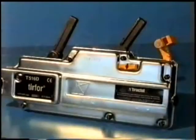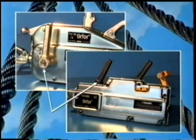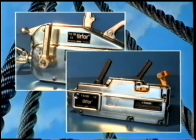The forward lever of Tirfor machines is fitted with shear pins which protect against overloads. These pins shear when too much effort is applied. However, the load is always held securely and reverse operation is still possible to lower the load to a safe place. Replacement shear pins are supplied with each machine so that work may continue once the load has been reduced, or you may consider using a higher capacity Tirfor machine or even multiple sheave blocks to give greater lifting capacity.